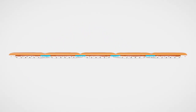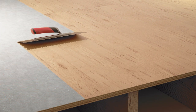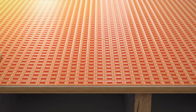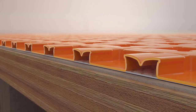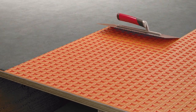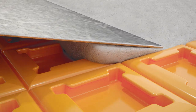The cut back cavities also create free space within the DITRA. The membrane is bonded to the substrate using thinset mortar. The membrane is embedded in the thinset. Tile is installed over the membrane using the thin bed method. The cavities are filled with thinset mortar. The air release vents at the corners allow for faster filling of the membrane with fewer trowel passes.